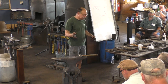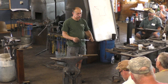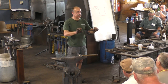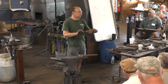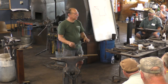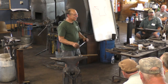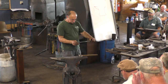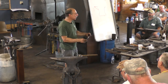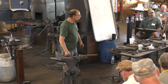And every time I see people do it, to my really fussy eye, they don't maintain the full stock thickness on both sides of the corner. Well, you guys do it with a torch. You can get pretty good results that way. Yeah, it's harder to do it in the forge because the heat is much farther around the corner on both sides. But I've set it with an air chisel right where I want to put it.